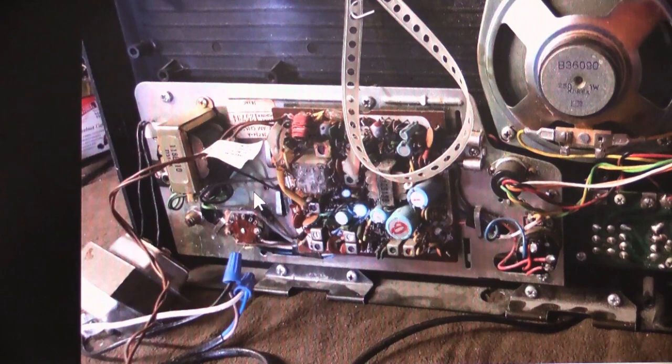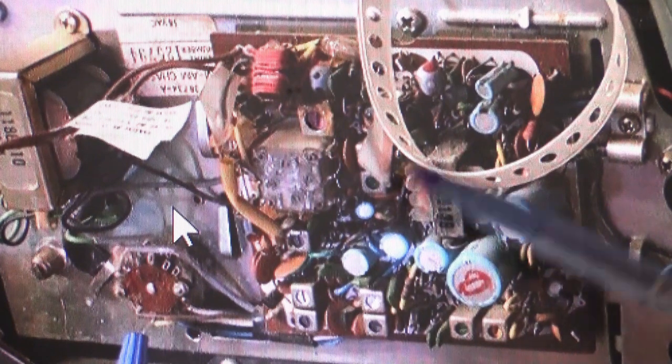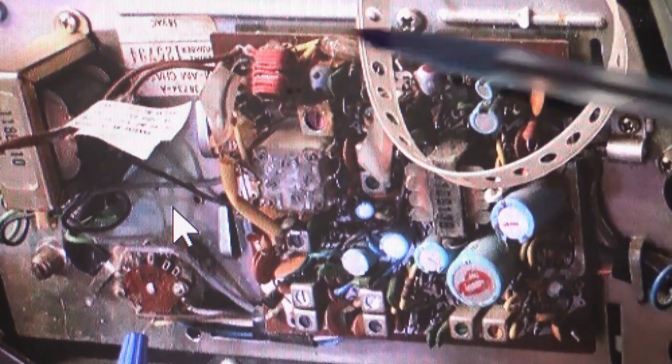And to refurbish a unit like this, a lot of these components should be replaced. If you don't replace them and they begin to fail, they may already have begun to fail where there are some subtle problems with how the whole thing works, but if you don't replace them, eventually they're going to fail altogether, and that will cause other problems. The primary problems on IMA203s, other than failing capacitors, are problems with the tuner, especially the FM tuner, because the FM tuner comprises probably 80% of this whole board.